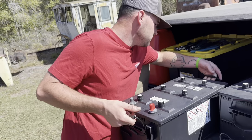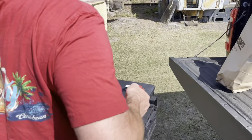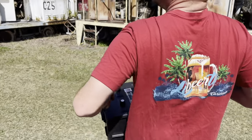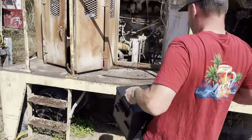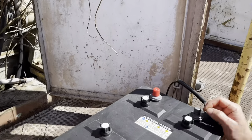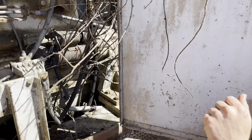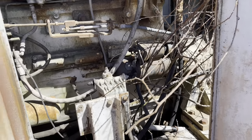I went to Rural King the other day — as you guys saw in our Will It Start preparation video — and bought two big old deep cycle 8D batteries. We've got some diesel right there, picked up some fuel line from Napa and some other stuff. We'll get these batteries dragged over there and wired up, and get those old factory battery cables removed. We're going to hook some batteries straight up to the starter. We checked the oil, and we need to get the intake pipe pulled off the turbo so we can spray some starter fluid down the intake.